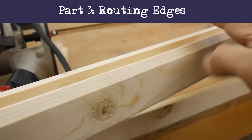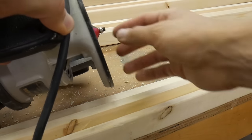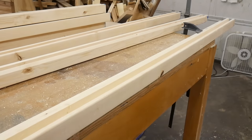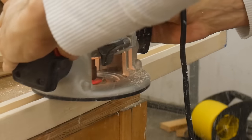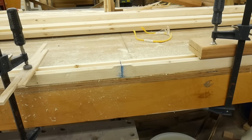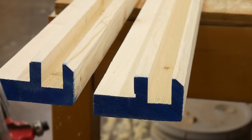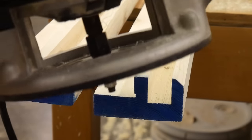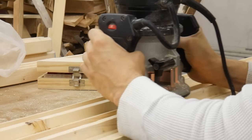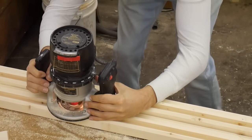The next step is to route the outer edge of the glass so that it can wick moisture away and not get caught on the sill and rot out. We'll be doing that with a sort of wedge router bit, a chamfered bit, about a quarter of an inch out. I've just got my piece clamped here so I can run the router along this edge. The ends weren't done — I can't really route the ends — so I'm clamping down each piece and meeting them so I can route right over that and get two ends at once. I clamped down two boards at once to get both of them in one router session. One little thing: I noticed I had to reverse a little bit to smooth out the wood, which is probably not the best router etiquette, but it got the smoothest result.